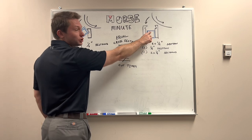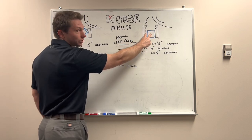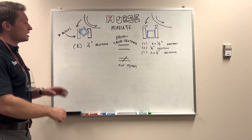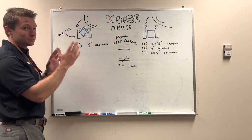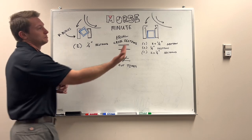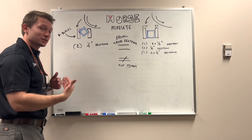On the improper side, you've got a 2 inch section, two 1/4 inch sections, and then another 2 inch section at the bottom. They're the same cross section, but they're going to give you two different cut times because of the way that your blade comes into the workpiece.